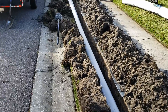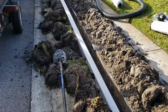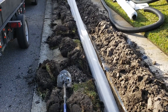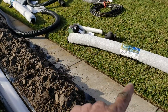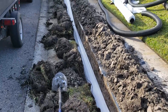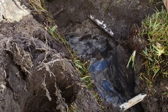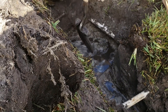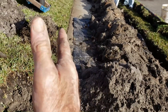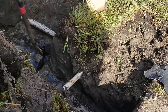Meanwhile, we're going to go ahead and line our trench with fabric. This is a drain field fabric, very thin, allows water to come right through it. We'll lay it out through here and then open it up. We're going to use both the easy flow, our peanut pipe which I really like, and perforated and gravel in this system. Over here, Joe's got the sump basin started, but you can see a lot of water clear back there into the yard — all that water comes from back here, backing in this direction under the ground. Once we put all this together, we'll be able to take care of all this water.